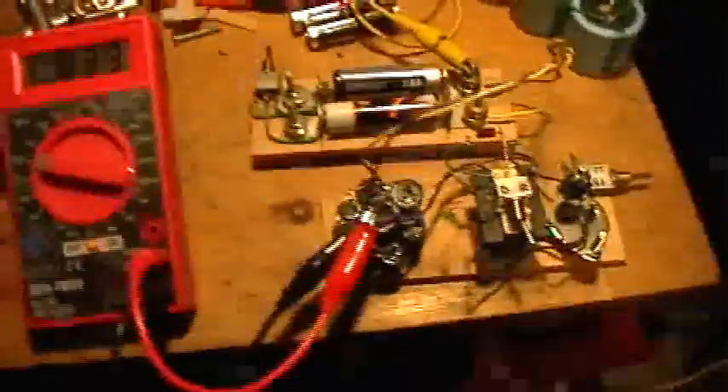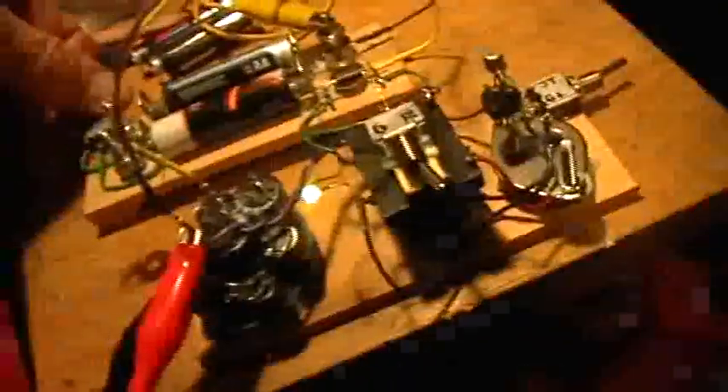That's why to really discharge an electrolytic capacitor you have to hold it shorted for quite some time. Now with the diode and resistor switch — to get the thing to run reliably as a low-voltage Joule Thief, I put the resistor across the diode, which is what this switch position does. And to get it to start oscillating reliably, I put that 220K resistor between collector and base. So in the Joule Thief position, with one battery at 1.14 volts, you can see the LED is glowing nicely.